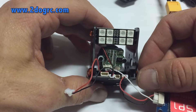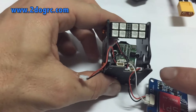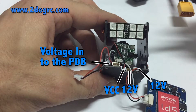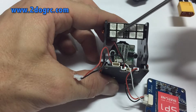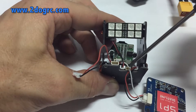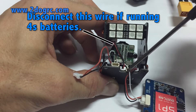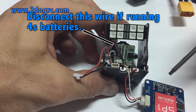This is all in the manual but it can be a little confusing. You've got three ports back here. This one is 12 volt, this one is 12 volt, and this one is VCC. VCC means battery voltage — whatever battery you put in is what's coming out. Right now this VCC is going to my LED lights, which is supposed to be 12 volts. However, this cable doesn't quite reach, so we're testing it here to see if that will work or if we need to tweak that.